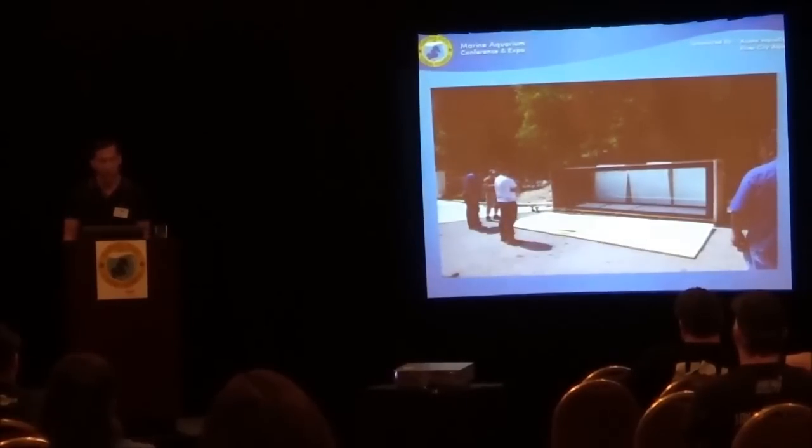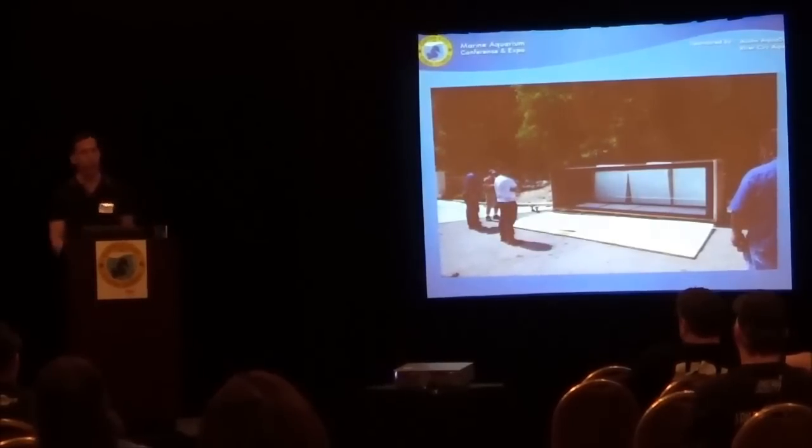And the manufacturer very nicely put it directly onto the flat bottom wood of the crate. So how are we supposed to lift this thing? Well, I didn't take pictures because I was too busy sweating it, but what they told us to do was instruct the forklift driver to drive up to the tank, put his tines against the bottom edge, and push. So it'll go between the wood and the tank. So he tried that from the long side first, and the whole thing just slid. So we actually had to go to the end of the tank to have enough friction to be able to force him under, then put risers, then come back around and lift.